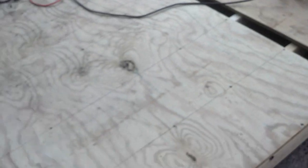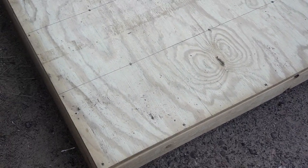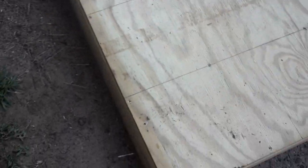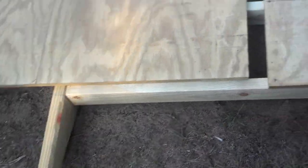You're looking at one-foot centers on the two by fours — all that means is the center of each two by four is every foot, except for the outer edges where you flush them off. All the others are centered on the lines I drew. Same thing here — flushed on the outer edges.